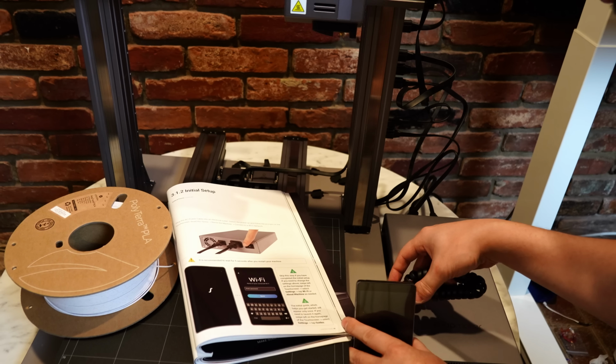All right, so that noise is kind of annoying. One thing about this machine that makes it kind of unique among 3D printers is that it's designed to be a CNC machine as well. And CNCs have to contend with much higher tool forces. That means that these actuators are a little bit overbuilt for 3D printing. Now, overbuilt implies that it's a bad thing, but there is one plus side to these being overbuilt, and that's that they should be able to handle very high accelerations. So we'll test that out.